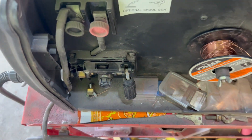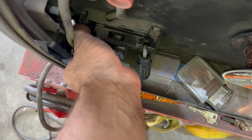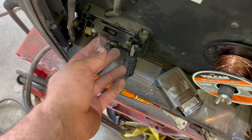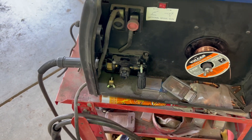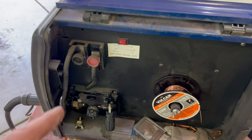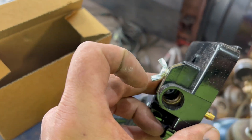If I was using this as flux core I could keep going, but I can't weld with that stuff - I'm not a master at it. Anyway, that plastic housing is busted - that's what's broken. That's where the drive is for our wire feed. This housing is one piece and it's got a hose on the back side, so I'm not entirely sure how we're going to take this apart, but I see a couple of screws. I think I can get those out. And here's the new part - see how it works, with the little hose barb where it feeds the gas into the lead.